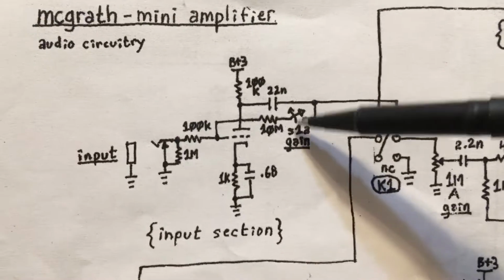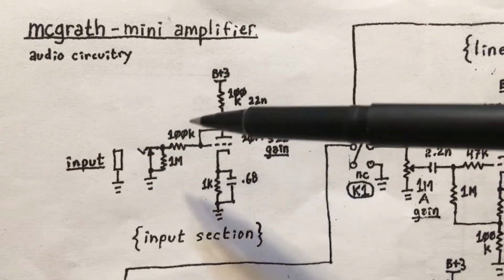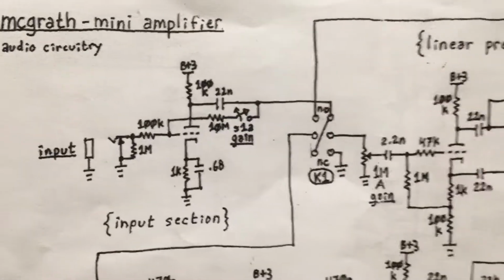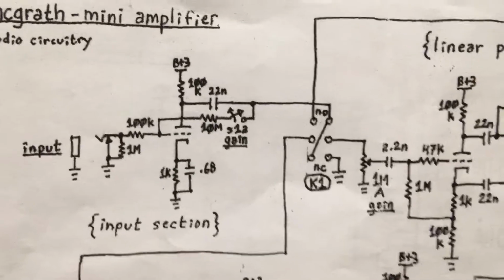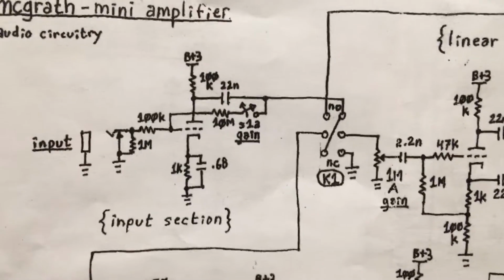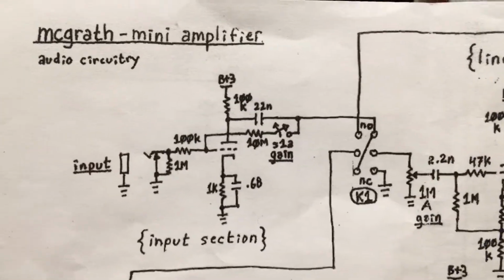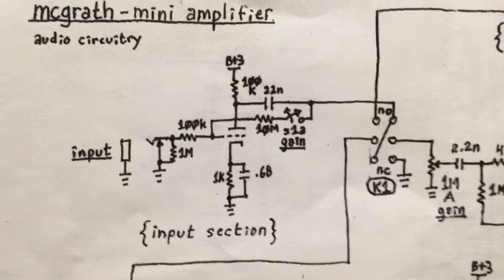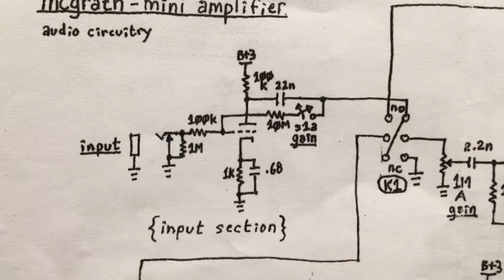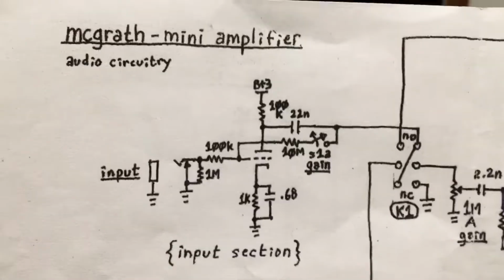Here's the gain switch. As you can see, it opens or closes a negative feedback loop on this stage. This general technique of kind of treating tubes like op amps and using negative feedback, it really works. I didn't know whether it would or not, and I sort of invented it or reinvented it myself and tried it, and it works about as one would expect.